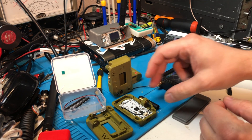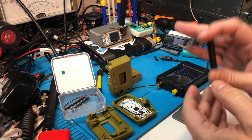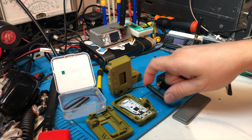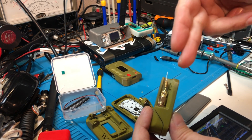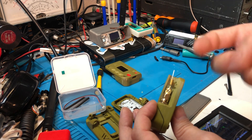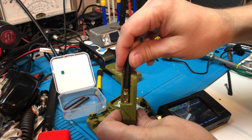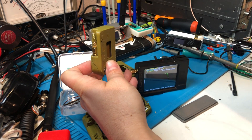So that's what we're going to do today. I've got one of the stock antennas that come with a lot of the kits. A lot of folks are just buying these cool little stubby antennas, and they happen to be set higher in the band, or for a different country. It also could just be that the factory, when assembling these, is coiling wire around a shaft and snipping it off — based on a pencil mark or the cutter being set to some measured length. In my testing for 906, I've had to add a length of wire to make it resonant, and that resonance changes when we put on the plastic. You can see it's shifted way over.